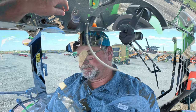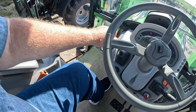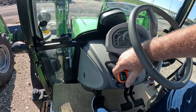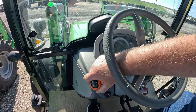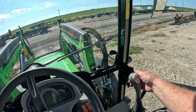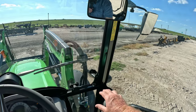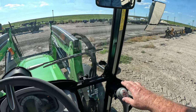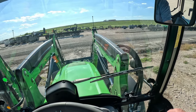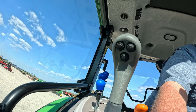Let's start on the inside. You have to use the clutch to shift gears, and you have a forward or reverse position just like any shuttle shift tractor. It does have a true third function on it — on your loader, it's already on the tractor. Deutz-Fahr puts the third function on the tractor. It has the valve for it, and the third function is already installed in the front. There are three buttons on the back side for that third function system.